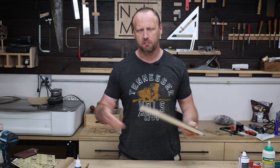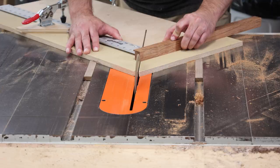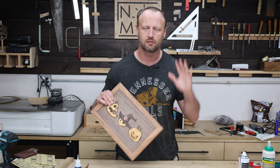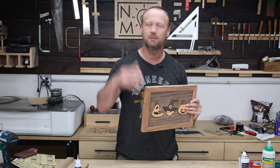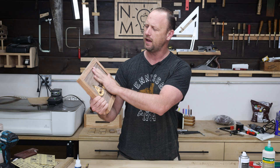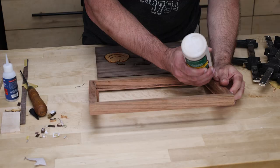I'm pretty happy with how it turned out. Now we need a frame — I always like to make my own picture frames. This one is out of Brazilian cherry I had sitting in the shop, just a couple pieces of scrap. If you're interested in making frames I've got a ton of videos on my main channel — just leave me a comment below. I'm going to glue this panel into the frame so it's all one piece, then wipe it down with some mineral spirits to clean up and get all the dust off before we apply finish.